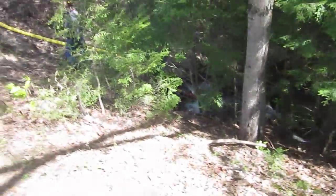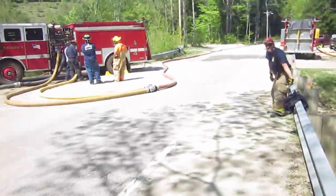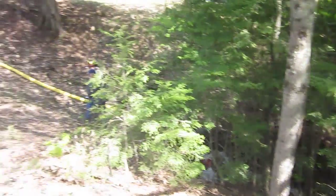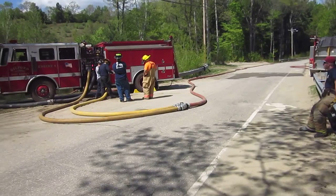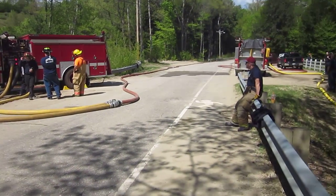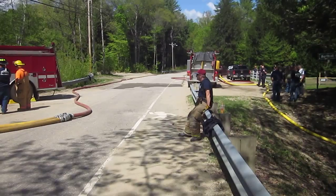Down there over the hill — the red device. So we've done three tests: at 100 psi discharge pressure we've flowed 320 gallons per minute; at 150 pounds discharge pressure we flowed 398; and at 175 psi at the Guilford engine we flowed 488 — so that's pretty good, that's nearly 500 gallons a minute through 3,100 feet of four-inch hose.